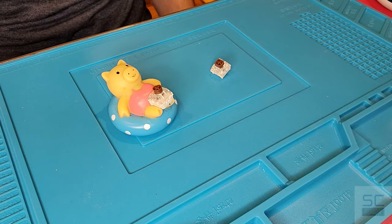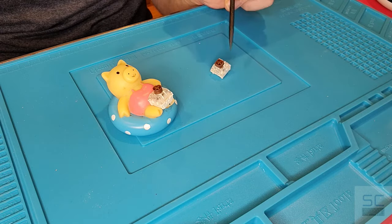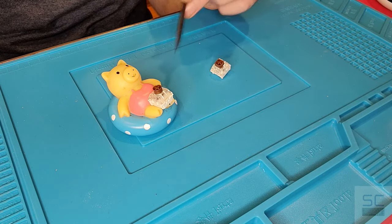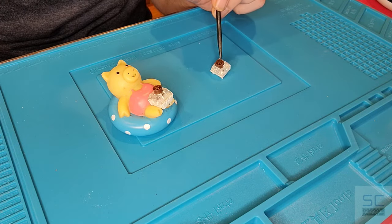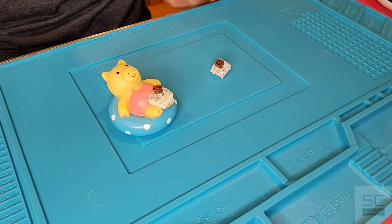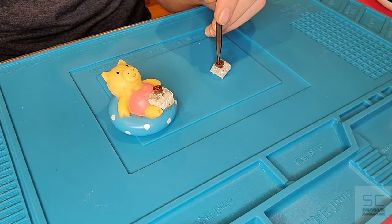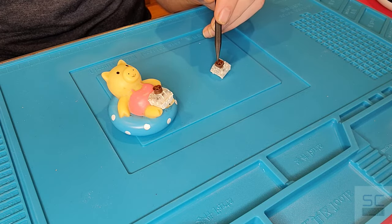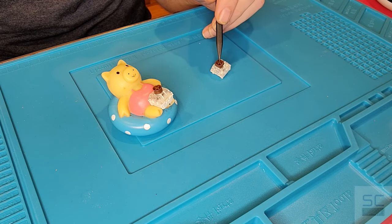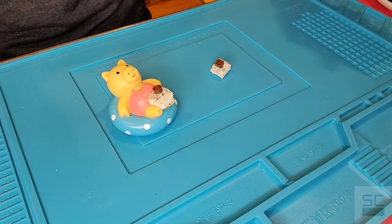One thing to really be aware of is I know that a lot of people actually think that box switches have to do with the shape of the stem, and they don't really that much. It's really more just that you have a solid stem around kind of the MX cross right there. That obviously is compatible with any kind of MX keycap and sort of the boxy format around it.